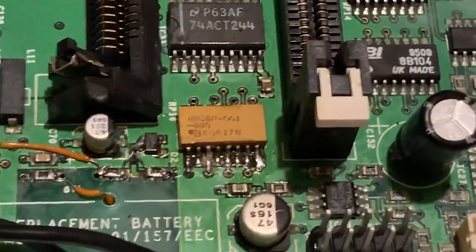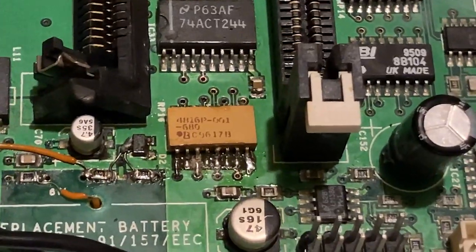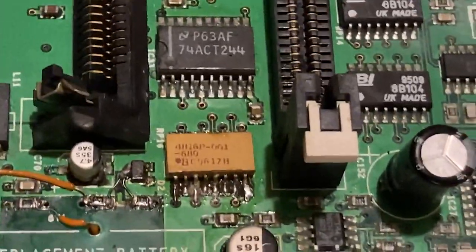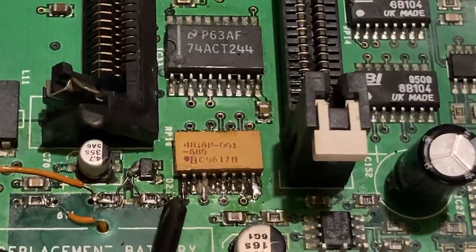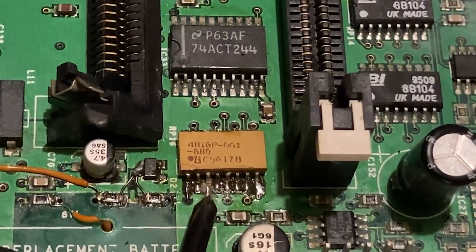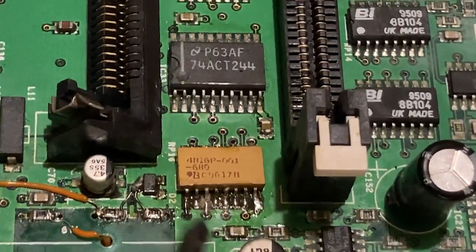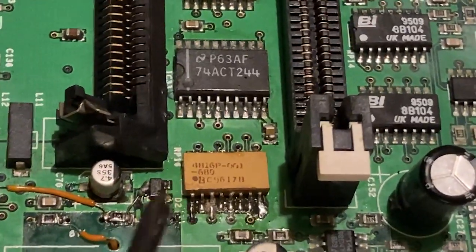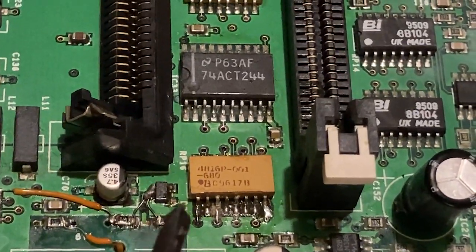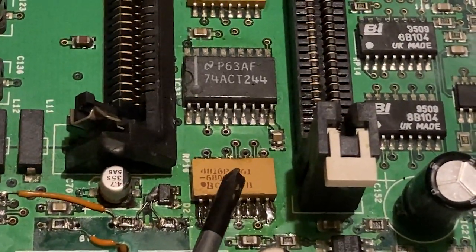Looks a bit messy. That's because I'm learning how to do it, and I've not quite finished. I need to do some more modifications. You can probably just about see here where I've brought those wires up from underneath and bent them across. This one needs resoldering, it's not gone well. In the process of doing this, I found that more and more connections were broken, and I also discovered that a lot of these, well, half of the vias are underneath the actual component itself.